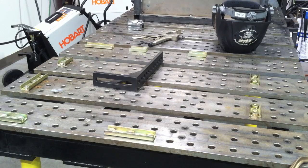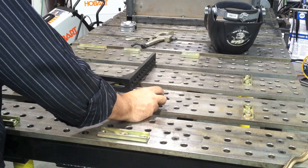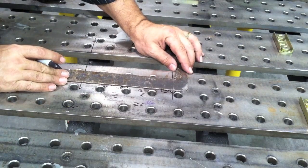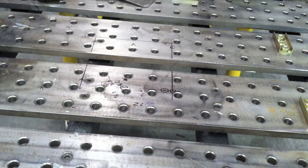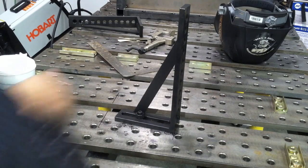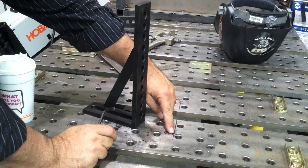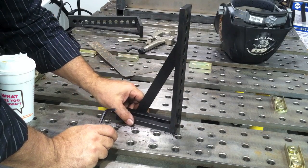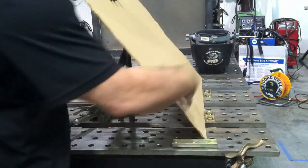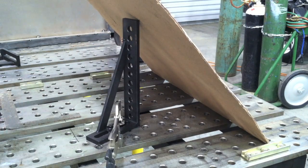I got really lucky on the little upside-down vent hood. These little bronze-looking threaded holes are designed to go underneath the table and provide a threaded hold-down in any place on the table through those holes. But the bolt hole pattern happened to exactly match the dimension of that upside-down vent hood. What I'm doing here is drawing a seven-inch square dead center of that pattern — this is roughly 27 inches on the outside — and that seven-inch square is how big I want my hole to be, roughly the same surface area as the eight-inch round vent on the fume extractor. I'm using a precision 90-degree riser to get my point up in the air for where I want that corner to be on the vent hood, and using a piece of cardboard to transfer that point.